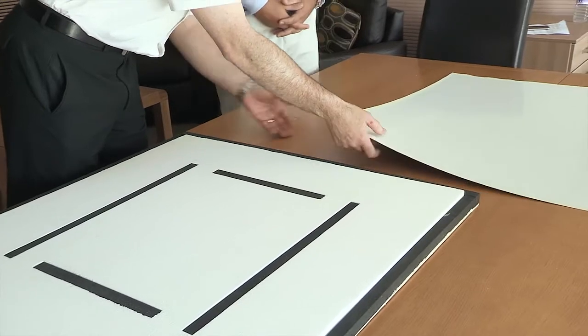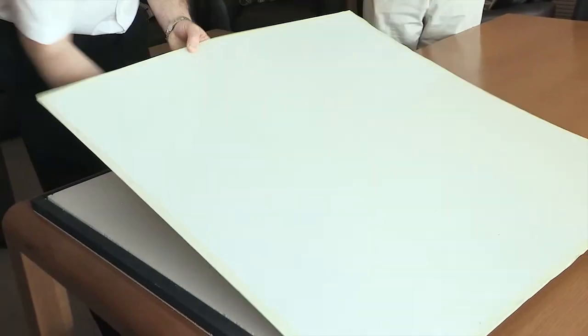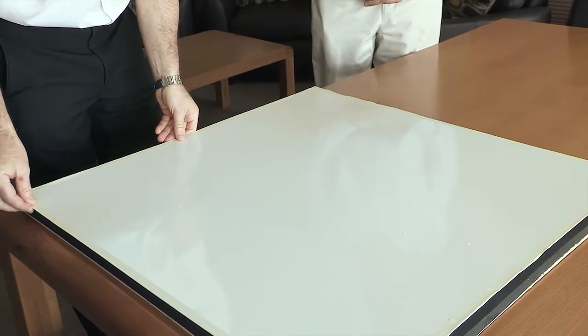And these are areas which will then be screwed into to make the fixings for those particular closures. The other thing we then do is coat the whole lot with another layer of adhesive, and we take the outer skin — a sheet of aluminium — and we then laminate all of that onto the panel. Now, each one of those components has its own inherent strength. However, as a collective within a composite panel, it creates an incredibly strong panel.